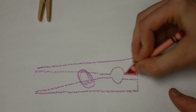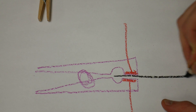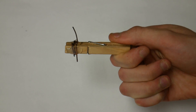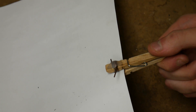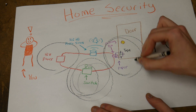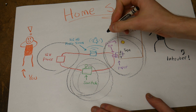Everybody's probably familiar with a household clothespin. This is what I'm going to use as my switch on the door. I'm thinking of having metal contacts right here on the edge of the clip, connected to wires, and having the clip pinched down on a sheet of paper which is taped to the door. So when you pull out the sheet of paper, it snaps shut and makes electrical contact. I already went ahead and made this switch with copper contacts and leads that I can solder into each end. This will go in series with my main switch to turn the system on and off. It will clamp down a sheet of paper — not making any electrical contact — and then when somebody pulls out the sheet of paper, contact is made. So if the alarm system is active and somebody pulls out the sheet of paper tripping this switch, current will be allowed to flow through the circuit and through the piezo siren, making a loud noise, and this will alert me.